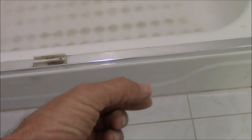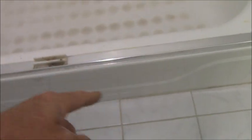So when you take out these walls, what I normally do is get a small sawzall blade and I cut the sheetrock all the way around. Then I can get a pry bar or something like that in there and start pulling the walls out, usually in pretty good sections, and then take them out. Once all that's done, the tub will come out after this is taken out. The only difference is, in this case, I have to save this tile, and getting the tub out sometimes is a little difficult because you have some floor material plus the tile that you have to avoid cracking.